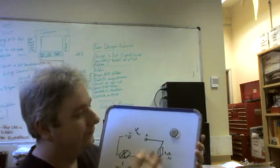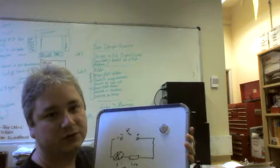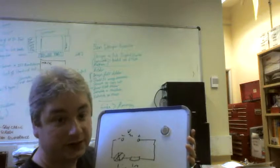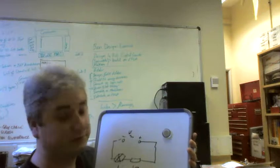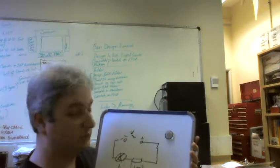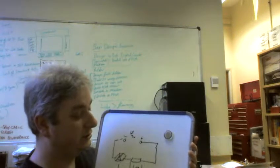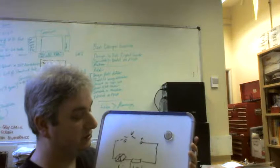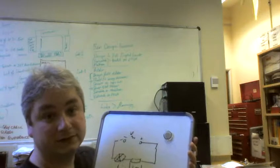The only way to combat that is to get rid of your multimeter and do it yourself. The multimeter uses resistances to measure currents, but you've got resistances in your circuit — so you could just measure the voltage across the resistor and use Ohm's law yourself: I = V/R. You want to know the current? V over R. Job done.